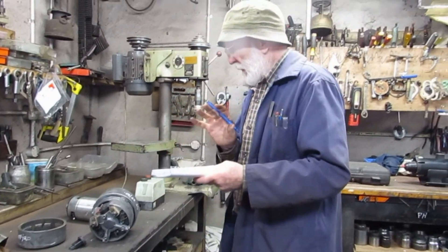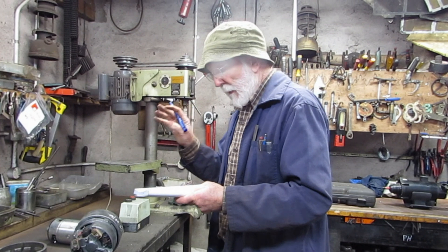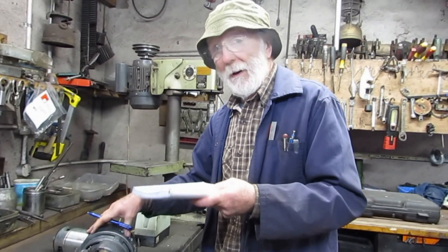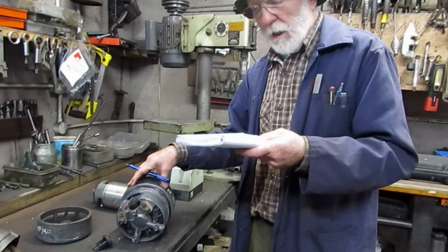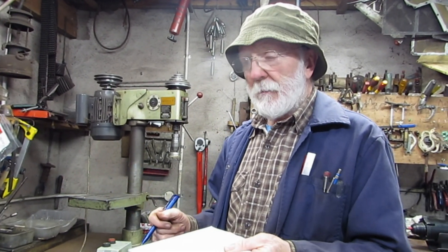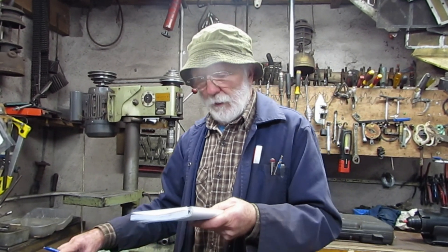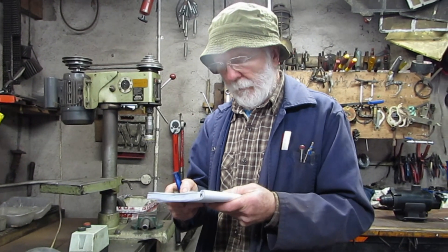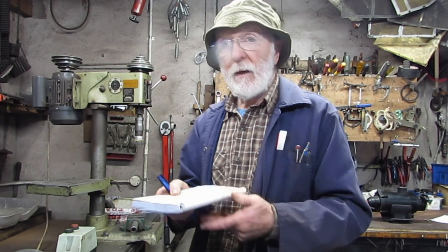The other models: the AC7 is just a bigger version of this. There's also a CAV 203, which is a huge alternator used on buses and things — I'll show you a photograph of that shortly. We'll stop at this point and go take a look at a test bench where you can actually see the AC5 working.